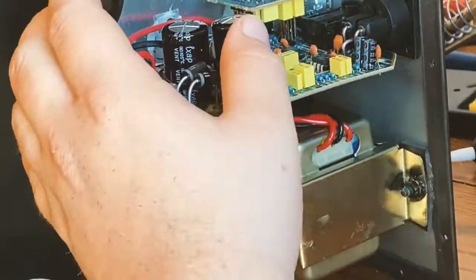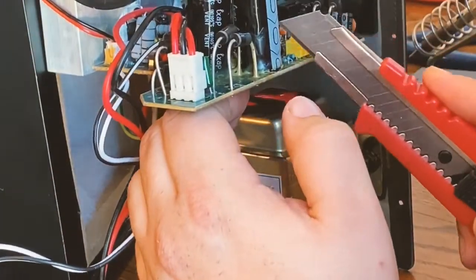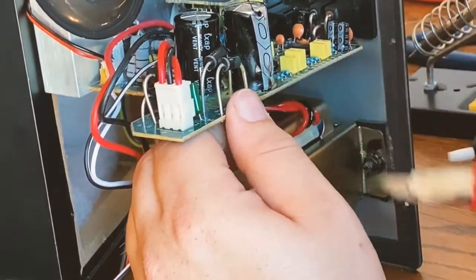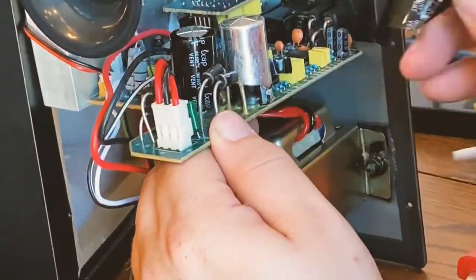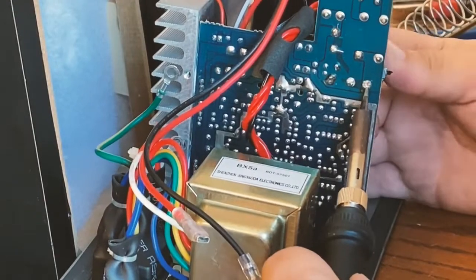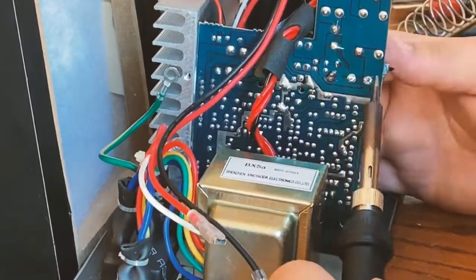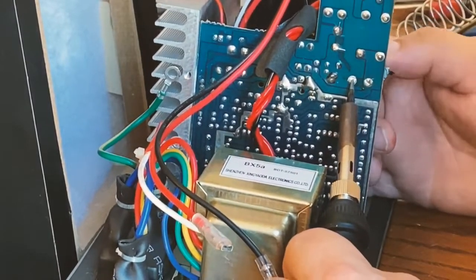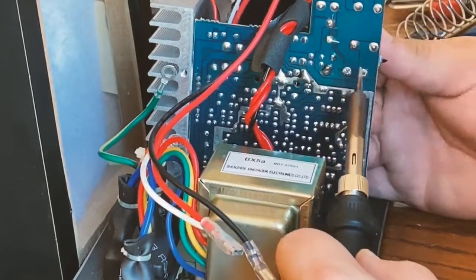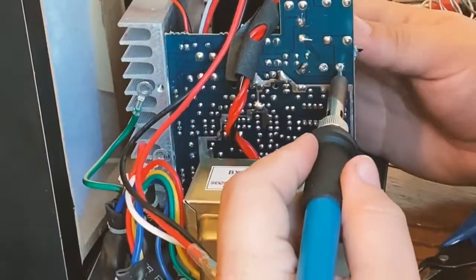One of the other challenges was getting the tape — actually the cover — off of the capacitors. I get in there with a razor blade. They actually glued the base of the capacitors to the board, so this was the best method to get in there and rock those parts out. After the cover was cut and it was no longer glued, it was pretty much free-standing, letting me rock it back and forth to actually pull it out.